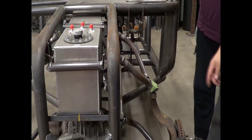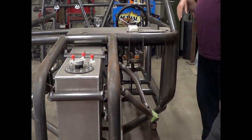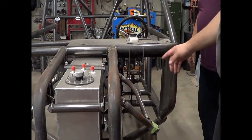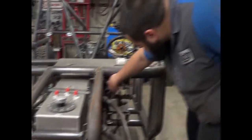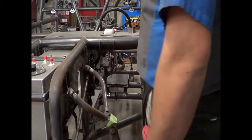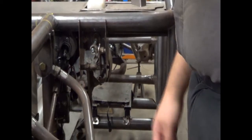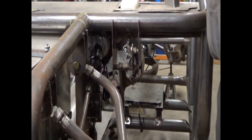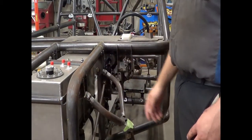And then up here is your electric pump. So that's where your power steering's at. Right, and that's what most new cars are going to. This is a little different style than most new cars. Basically what it is, it's a gear in here. It's a worm gear running to another, I don't know what you would call that. I guess a ring gear. And it has a sensor on this side that senses the pressure that you put from the steering wheel, and then it has a power assist that comes out and runs into the rack.